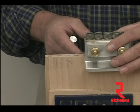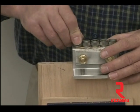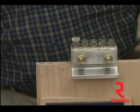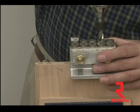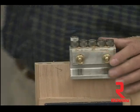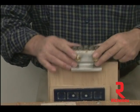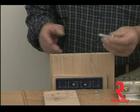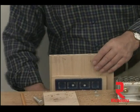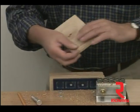Move the unit down. Place the indexing tool in the required bore and drill the last 2 dowel holes. Using the indexing tool allows you to work your way down any length of workpiece. Remove the first workpiece. Insert the second workpiece.